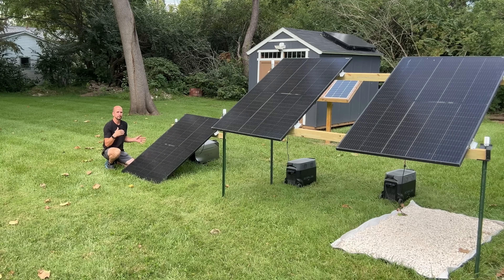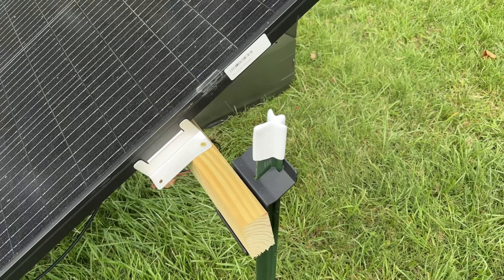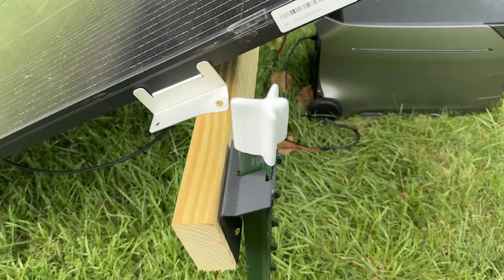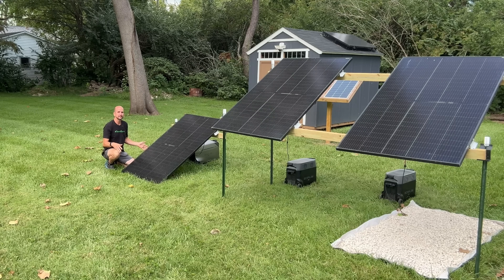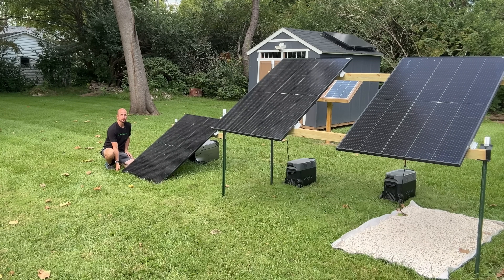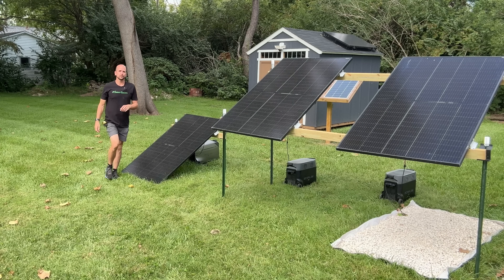For the three different mounting setups, we have a classic DIY where the panel is just laid against and leaning on something on the ground. We have two T-posts with a pressure-treated 2x4 laid on some custom T-post brackets — handy for mounting panels, with a link in the description. But this low-ground setup was the point of common criticism: if you lay bifacial panels on the ground, don't expect gains, because you're not getting any light underneath.